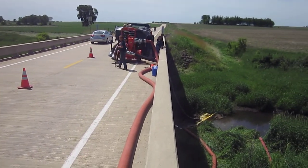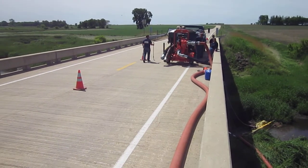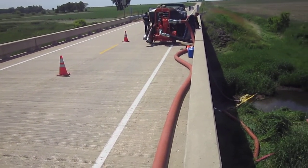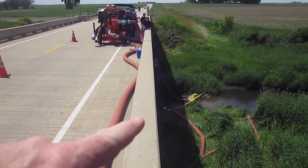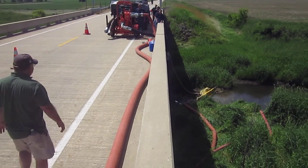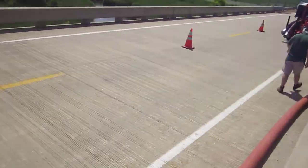We got the EMA pump up and running. Like we said, at 1,700 gallons a minute at 60 to 80 PSI, which is what it shows on the performance chart. It's drafted off the side of the bridge with about a 16-foot lift, primes without any problem whatsoever, feeding six-inch hose.